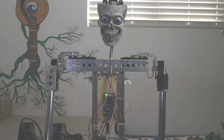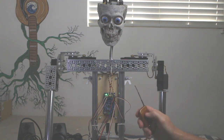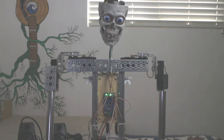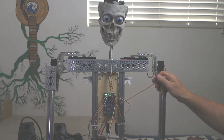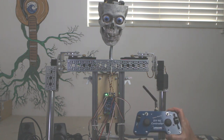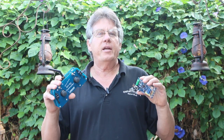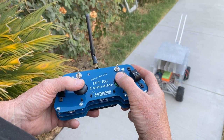I'll push Record one more time, hold down those two buttons, turn the eyes on, and you can see that I'm switching it — it's an on/off switch, so for eyes I would have it fully turned on through the whole period. At the end of the routine I turn his eyes off. I don't have to push the Record button. When I'm happy with it, I push and hold for three seconds then release, and now it is saved. I can turn my transmitter off — it's fully recorded. By using either the PIR or a push button, I can trigger that routine.